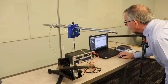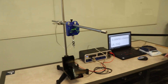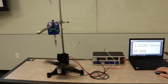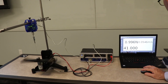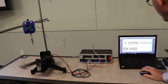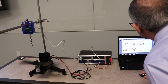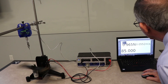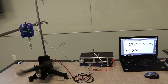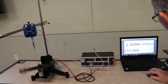Turn it on again. You can see it's giving us the speed — 0.54 meters per second — very consistent with little fluctuation. This is the force, and it's jumping around a lot. You can ask for an average force by selecting 'mean,' which gives a running mean value. Let's also set the force sensor sampling rate to 50 Hz.